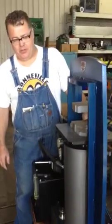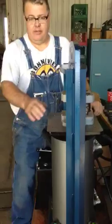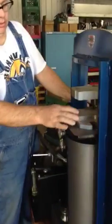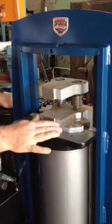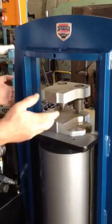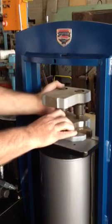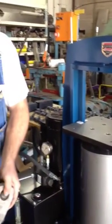It's as much production as you can get out of a hydraulic press. It's designed to take a die shoe, which is this right here. If you're looking at this, you probably know what these are — these would hold your tooling for stamping. And once you're done with that die, you can remove it and put another one in to continue on with a different stamping project.